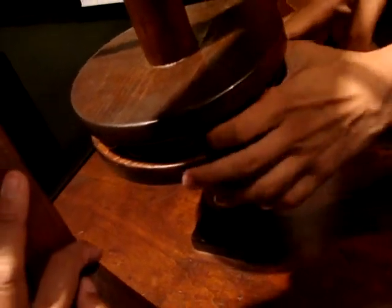There's not a lot of balls in here. If they had put more balls in the ball bearing, it would have worked a lot smoother — or they would have this. What modern ball bearings have is spacers in between, because having too many ball bearings will cause friction between them. You don't want them to rub against each other.